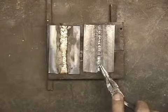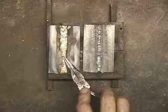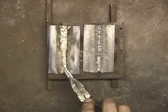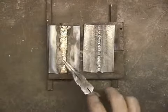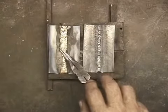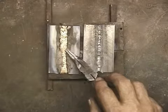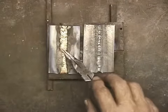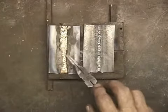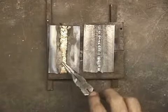This weld is going to be stronger than the braze, but this braze is plenty strong, especially for the type of work that I do. It's also faster. I tend to use a lot more bronze in doing metal sculpture because I'm using it for effect — I'll want to melt some of the bronze around because it gives a good contrast, especially if I'm brazing copper. But this is mild steel. So there's a gas weld and a braze — that is the difference between gas welding and brazing.